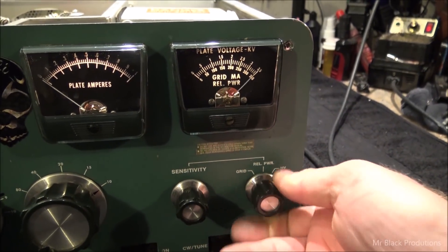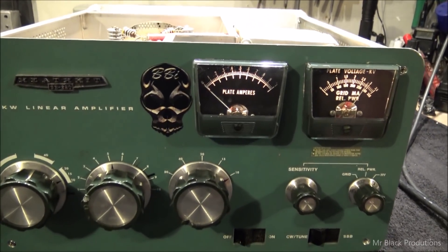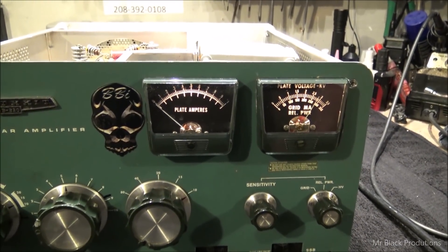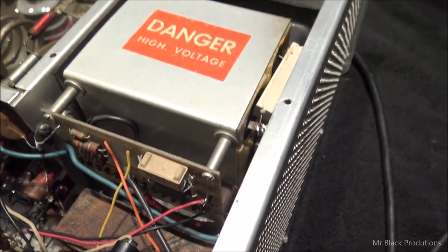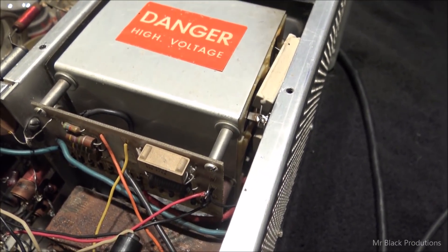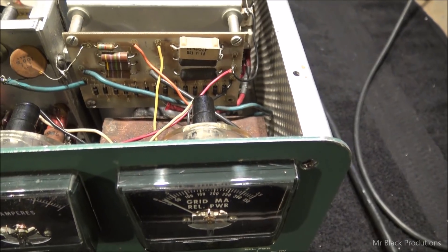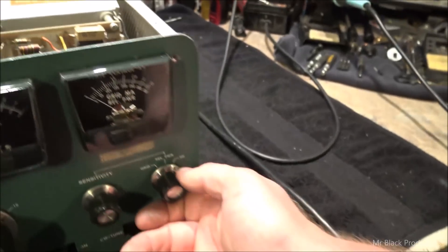You'll notice something really cool. Everything's working now. If this thing was working, I don't know how. There was a lot of different things that were disconnected or the wires were broken on it. The primary thing that was wrong with it was the high voltage capacitor bank had four electrolytics in it that had drained, dried out, split, and shorted. Then I had to rebuild half the high volt board — half the diodes were out on it. So we got that all fixed up, and then it was just the game of getting the whole front end to work again.